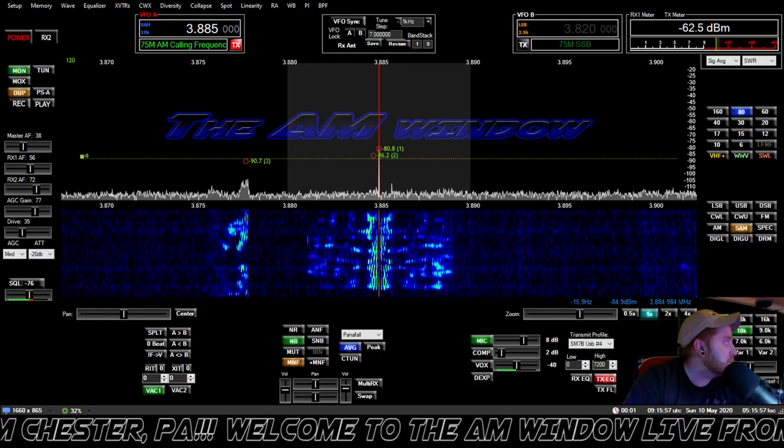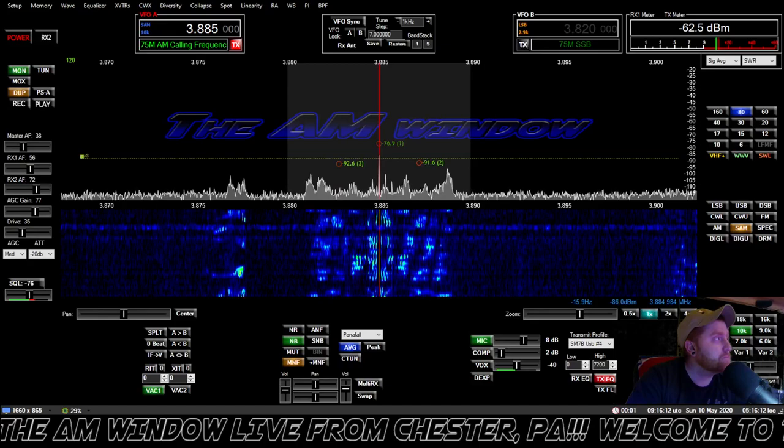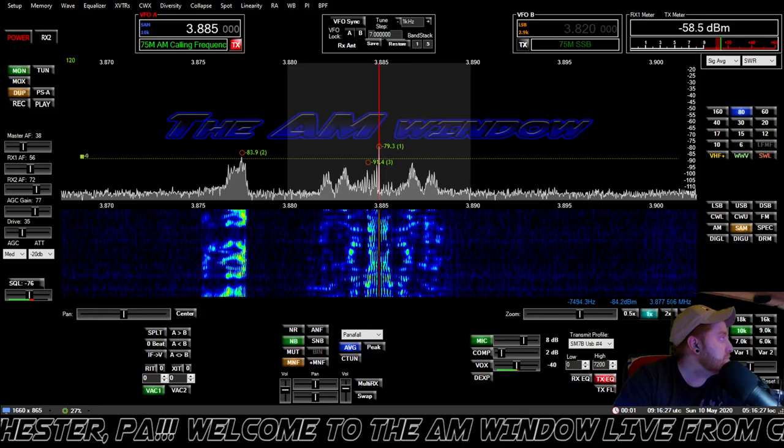That was my experience with those turnstiles on the 20 meter band doing slow scan, because you're watching the image as it's scanning and you're receiving it, and during those phase inversions you could see swaths of white noise in the image. When I put up my turnstile there on 20 meters, it virtually eliminated that from happening. So it has its advantages for doing that.